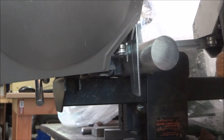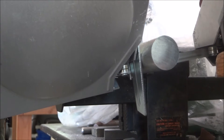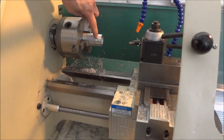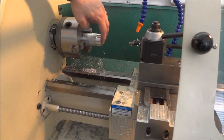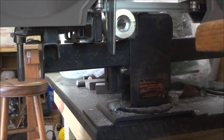In today's video we're going to be working on our shims that go in between our bearings and our bushings. I cut the shims out of some inch-and-a-half aluminum stock and then took it out to the G0602 and I'm just turning the outside dimension down to 34.98 millimeters so it'll fit down in our bearing pocket. The inside of the bearing is about 25 millimeters. I just need to trim it and size it up to length on the manual lathe because each one is going to be a bit different.